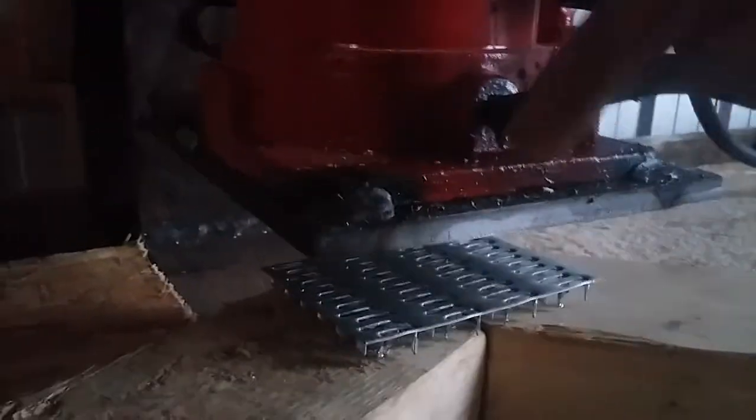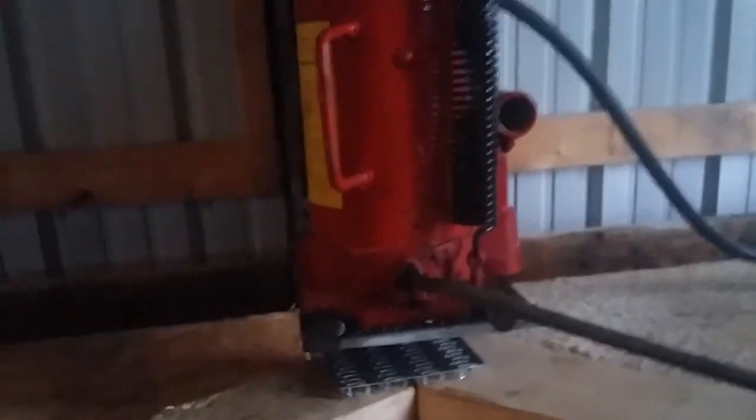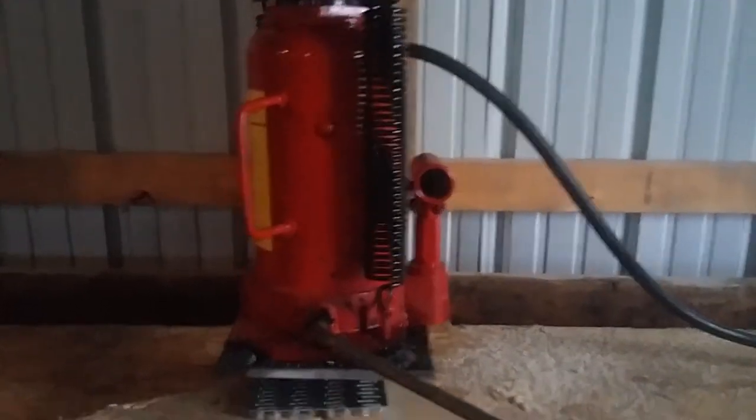I put a nice — see if you can see it here — a 3/8-inch piece of steel on the bottom just to make sure I don't break something. 20-ton is a lot of force, and that is what they recommend for these truss plates for pressing — about 20-ton. The PSI, I don't remember what it was anymore, but I sat down and figured it out. I welded the bottle jack to the top of that beam so it goes up.